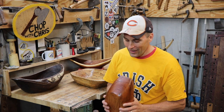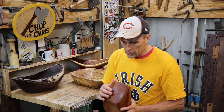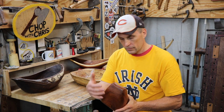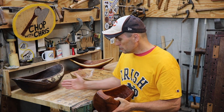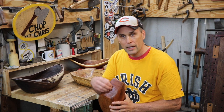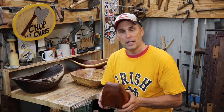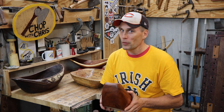In terms of what you should do if you get a crack in your bowl — you should panic. No, I'm just kidding. I do panic, by the way. But you will get cracks occasionally in the end grain. What you do is get another piece of matching wood — like cherry — and use a saw to create some fine sawdust. Then take super glue and put it into the crack, which will penetrate and seal the crack to keep it from cracking anymore. Then you rub the sawdust into it, which makes it match, and then you sand it down. That's how you take care of cracks — don't panic, but move quickly.